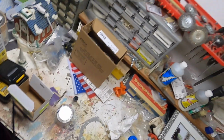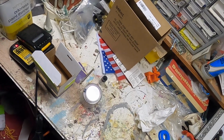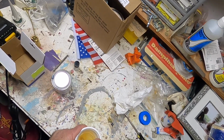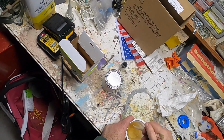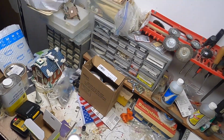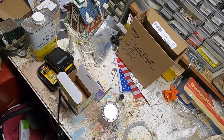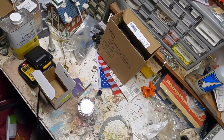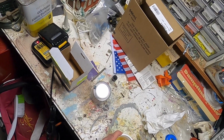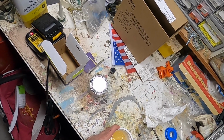At this point, the hull survey has been completed, and it passed fine. There was no moisture in the deck or the hull. There were no blisters on the boat, so the hull is in good shape. Now the rest of the survey will be completed this weekend. Once we get that report, we will also be reviewing the oil samples, which were taken last fall when the oil was changed. So the oil is relatively fresh, and it won't make sense to take new samples. But if everything looks good, we'll make a decision on whether or not to go forward.